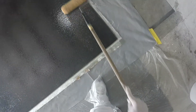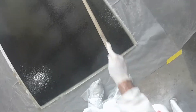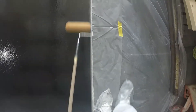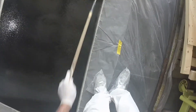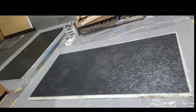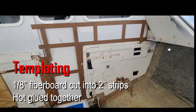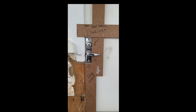I didn't save this roller — at some point you have to weigh the cost of acetone versus the cost of the roller, and this would contaminate a large amount of acetone. I did prime those panels, and as the vinyl ester gelled, I went ahead and did the layout. Now here we are back in the boatyard. I am templating the landing for the engine box and also templating the bulkhead section that we're going to remove in great detail.